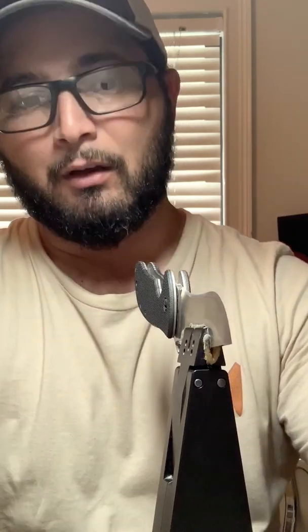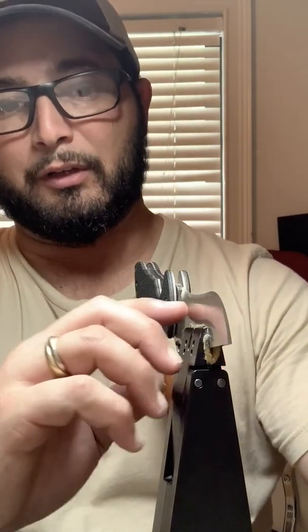Again, at that point, it's all show. It's all to get that mirrored edge. It's all for the aesthetics, and there's not really too much functionality beyond 2 micron. It's all getting a really, really popping mirrored edge. You could argue that there's no functionality past 1000 grit. But basically what we're doing is getting a really refined edge, and it's a really sharp edge.